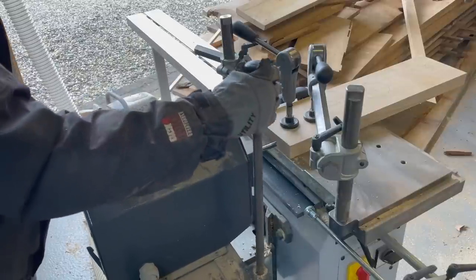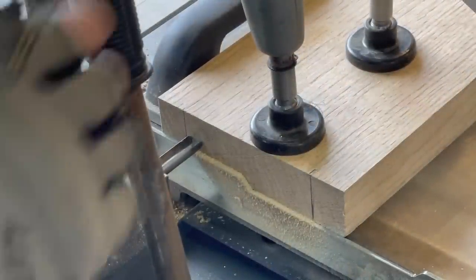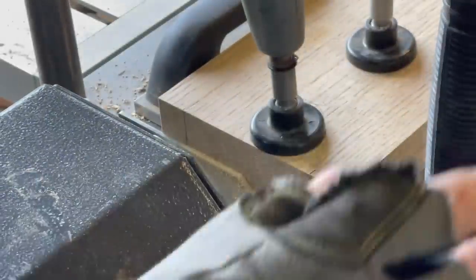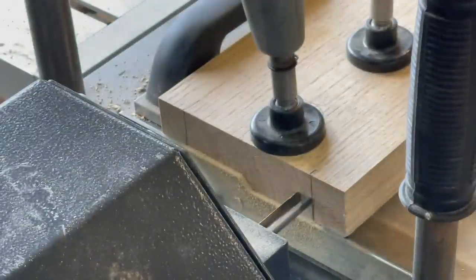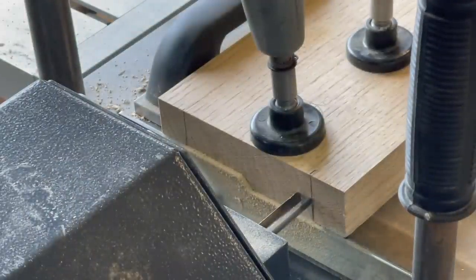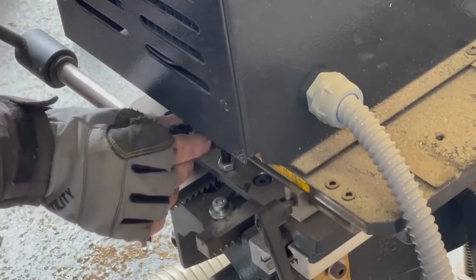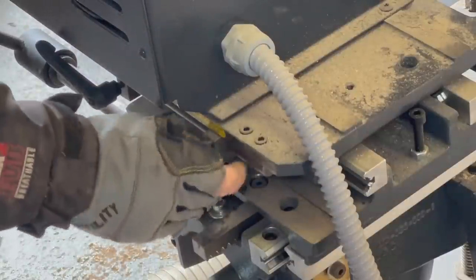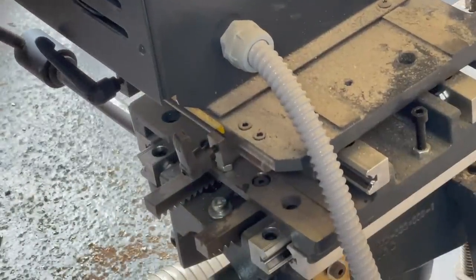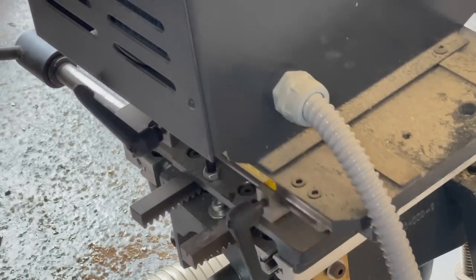What I've found against the end grain is the machine is much smoother if you actually cut like you're sawing with the bit. You can see the pencil marks here — we're going just past the blade, right in there. It's very easy to adjust and very quick. On the back we've got it in position and we just move this stop up to there. As we move across to the other position, loosen it off, bring the blade exactly where you want it, bring the stop in and lock it — and that's now your two positions set.